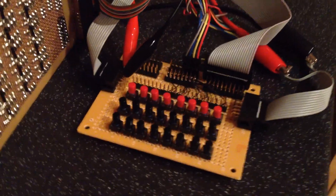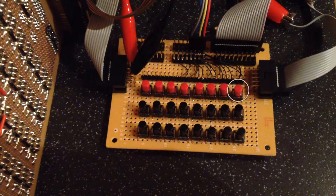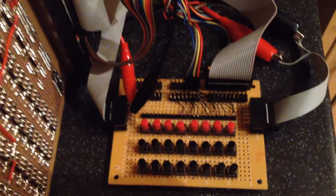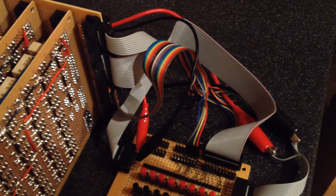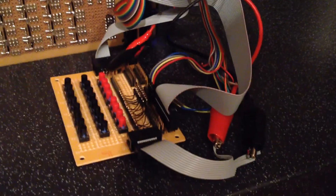The top row of red buttons is connected to the four control lines on the data bus. From the right we have F0, F1 and F2 comprising the function code input, followed by the condition register load line. None of the other buttons are active this time. The control bus ribbon cable was used to carry out some bug fixing — the internal carry-out line wasn't working, and it turned out it simply wasn't wired up on the arithmetic card.